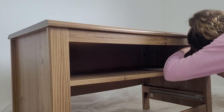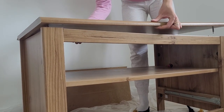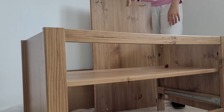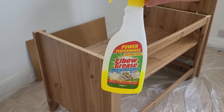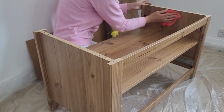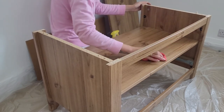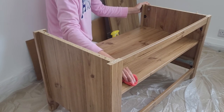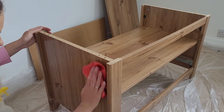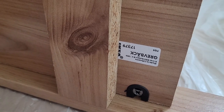Removing the top was actually easier than I thought — I turned the screws and then gently lifted it off. I was glad I could do it as this will make painting so much easier. The first step in painting laminate furniture is to clean it very well. The best method is to use a degreaser and a cloth. I go around the whole piece making sure I haven't missed any spot, then I use a clean wet cloth to wash off the degreaser.